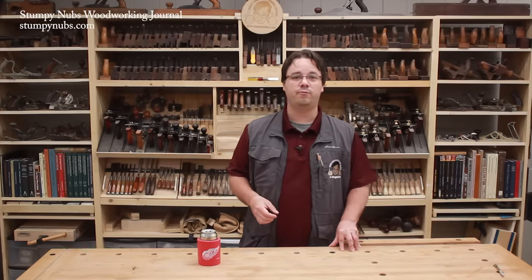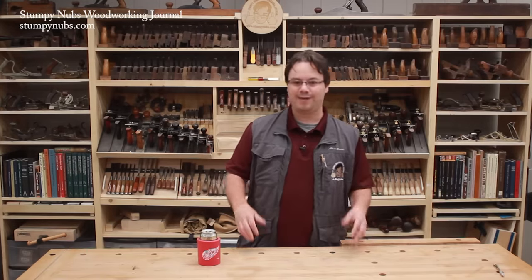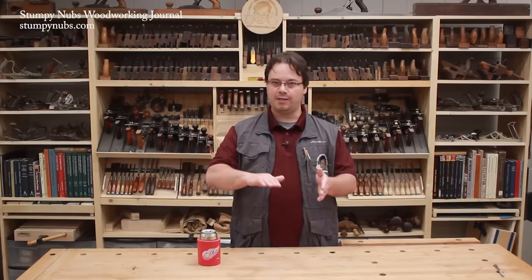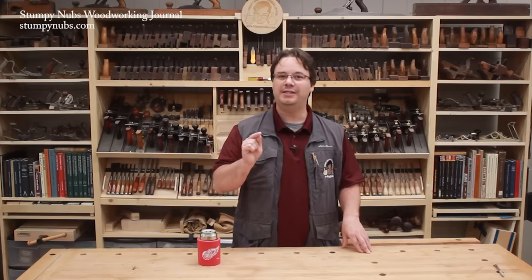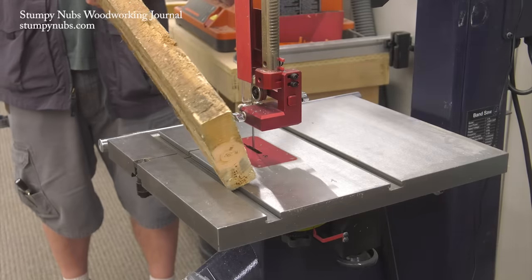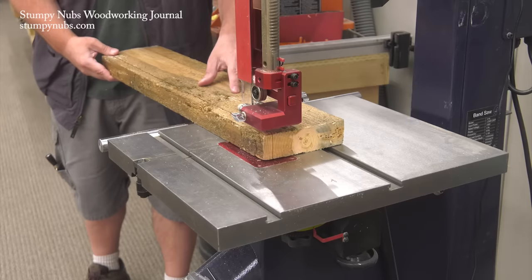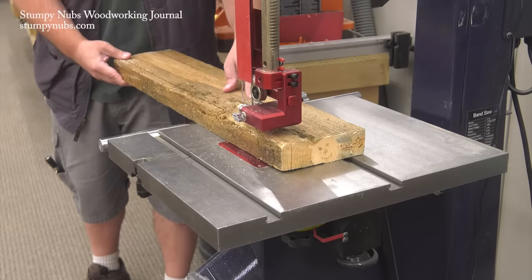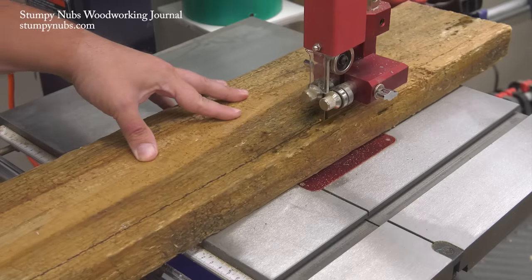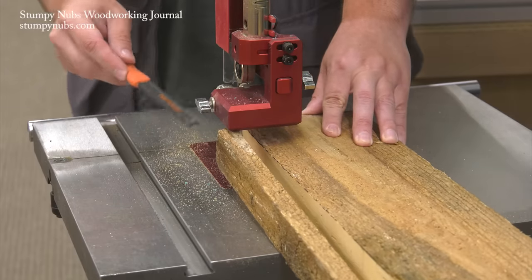Another important safety feature of a bandsaw is the ability to cut rough warped boards. For example, let's say you have an eight-inch wide rough-sawn board and you want to rip it down to six inches so you can flatten it on your jointer, but there's a cup or a twist in it. That could lead to a dangerous kickback if you try to rip that on the table saw. But a bandsaw can rip that workpiece no problem — no danger of kickback. So I use my bandsaw quite a lot when processing rough lumber. It's safer than a table saw for many of those cuts, and easier and more efficient than a handheld circular saw.